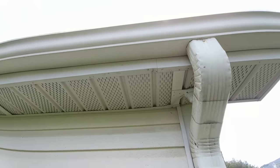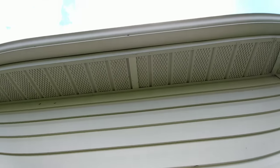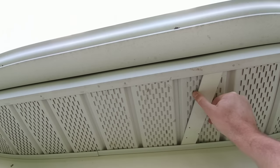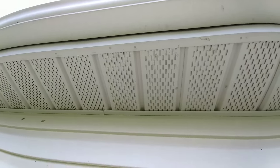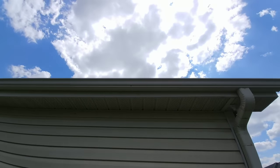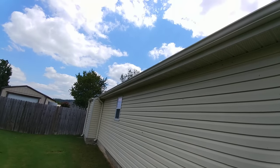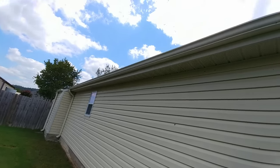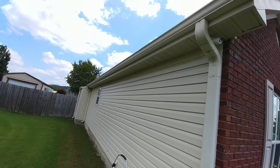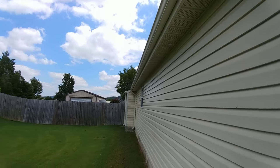The nice thing about this is if you want to move the camera, there's really not much damage to the soffit. You can actually just take it — whether you siliconed each corner or used a nail — pull it out, put the nail back in, and remove this. I found after installing the cameras in a couple of places outside that I wanted to reposition them, and it worked out much better. One thing to keep in mind is that some of this vinyl soffit they don't make anymore, and it's hard to match if it does break. So good luck on your installation and thanks for watching.